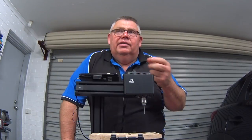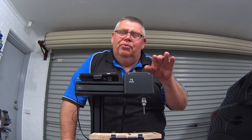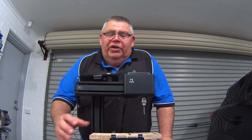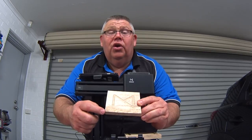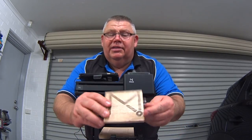The software sees a picture and instead of doing a proper toolpath, it does a raster toolpath — so it's like an inkjet printer moving left to right and top to bottom. When you set up your work offset, it only sees the bottom left corner as the work offset.